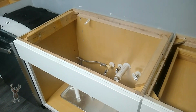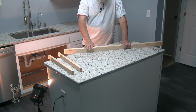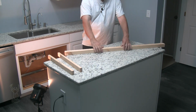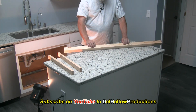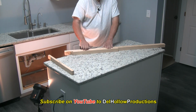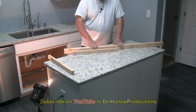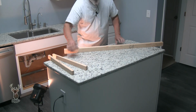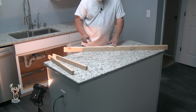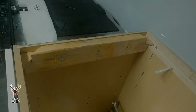I'm just going to silicone a little lightly around the rim. As you saw in the preceding video clip, you saw a 2x4. Now this is the rest of one after I've stripped some off. But the 2x4, this is the 1.5" dimension. So this would represent the tall side of the ledger. You saw how we put that in there. We had 3 T-nuts, 1/4-20s coming into it from each side so that I didn't have the screws